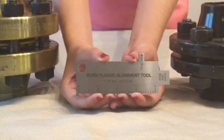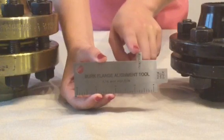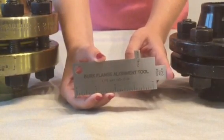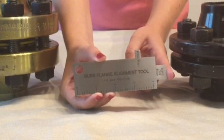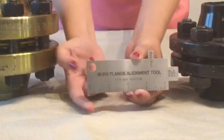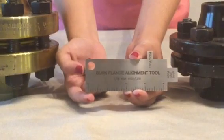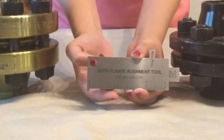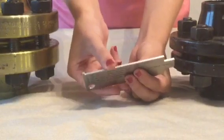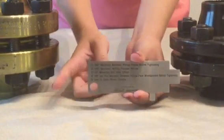The tool has a 150/300 pound nib and a 400 pound and over nib to check the gasket crush and flange parallelism. It also has a 1/16th inch scale to check maximum centerline high-low. As a quick reference, the maximum allowances for a flange assembly are etched on the backside of the tool.